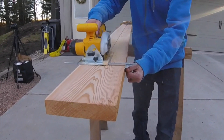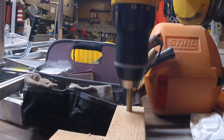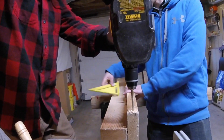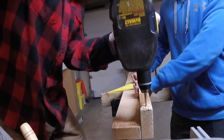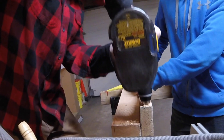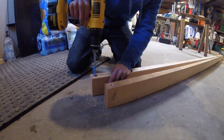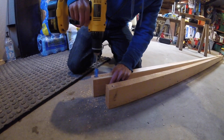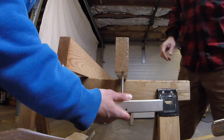Three batteries later with our cordless skill saw, we have 2 Douglas fir 2x4s that will act as rails once we attach our brackets. We then mark out and drill the through holes for the bolts that will attach the brackets to the rails. After all 4 holes are drilled, we use a spade bit marked just deep enough to counter-sink a hole to hide the washer and nut so it does not interfere as a portable chainsaw mill runs across the top of this rail.